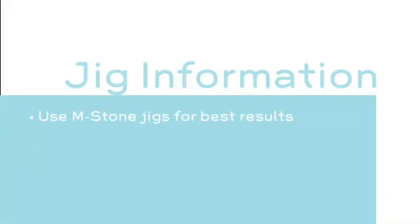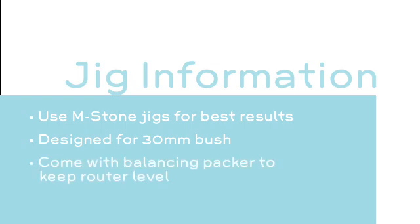The reusable M-Stone jigs will ensure the best results. These are designed for use with a standard 30mm guide bush, and the special M-Stone cutters are supplied with a balancing packer to support and level the router through the cut. Encore jigs must not be used, as it will result in the cut being the wrong size. If you're making your own jig, please use the cutout as a similar packer.